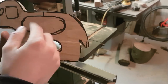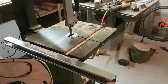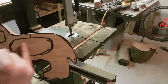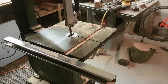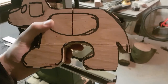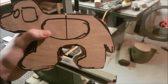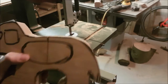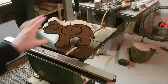Cut the outside off completely. Now it's time to take out the center. The easiest way to do this is to just cut in with the band saw straight down that line and then carve this out. That's the line you're going for — just take your time to hollow this all out. Make sure that if you're going to back out of a cut, you stop the machine so that the blade doesn't stop tracking and end up coming off, possibly causing injury. I'll come back when that's done.